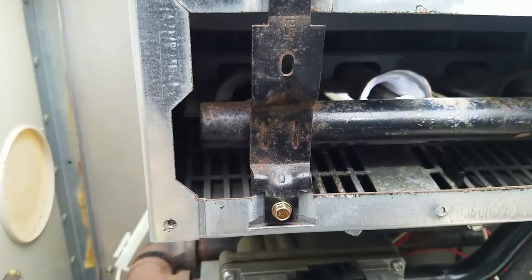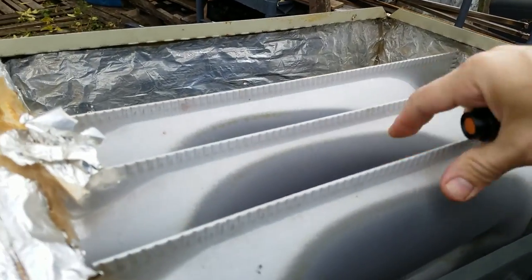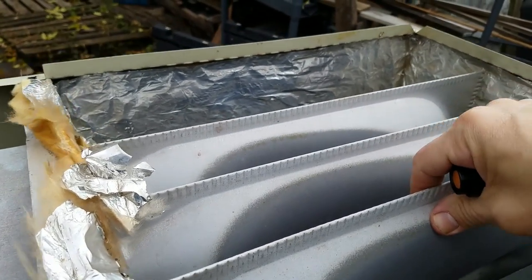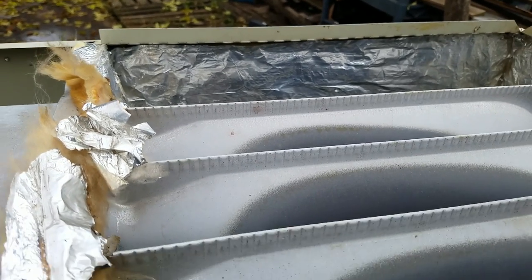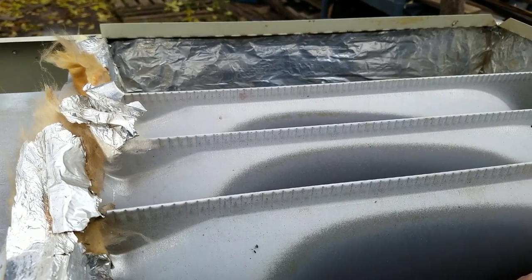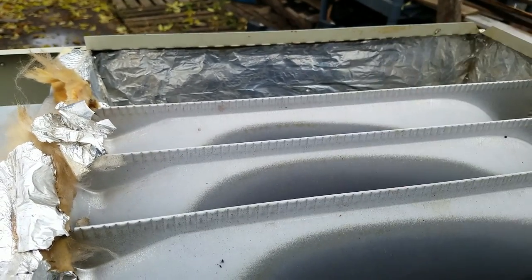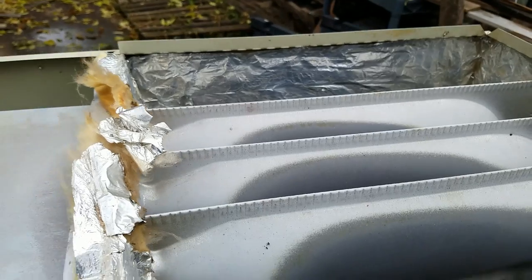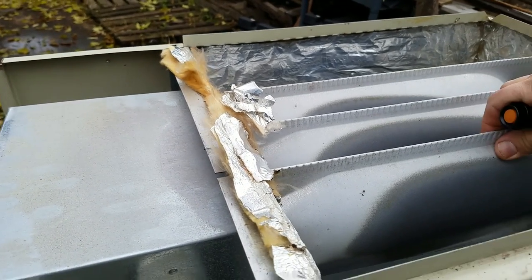And that is how the air is heated. Now the air is forced through these tubes. This is called the platen, and goes down, and the air is forced from underneath by a fan, rises up, shrouded by these so that all of the air comes through in between these pieces. The idea is that it heats the air safely.